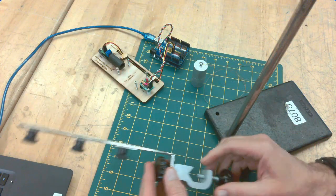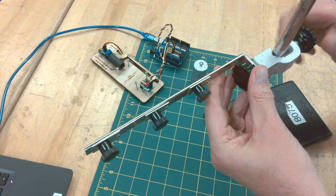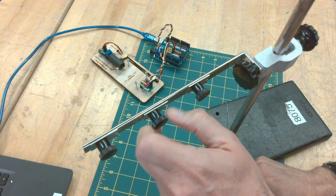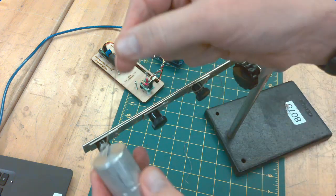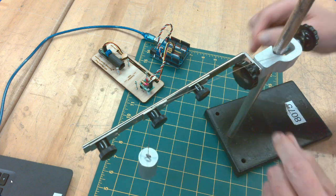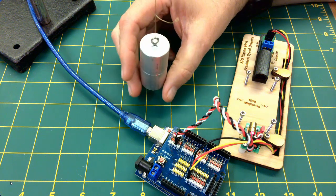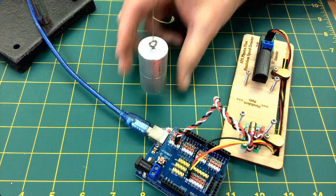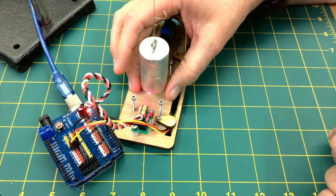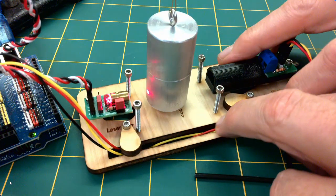Secure the pendulum to the pendulum clamp like so. With the pendulum hanging vertically without swinging, slide the speed detector so the pendulum rests within the space between the tall screws. If the wires are getting in your way, put them in the wire chase and secure them with the little cams like so.